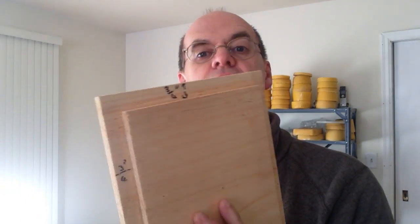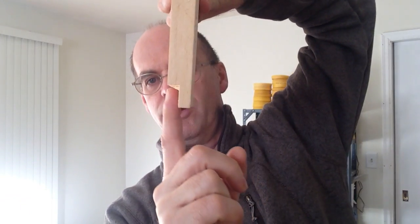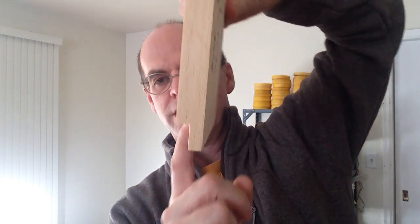I'm not a woodworker. I only make these when I'm alert — I've got all ten fingers and I intend to keep it that way. The most finicky cuts are on the table saw. I cut the rabbets with the fence on the table saw, running the wood flat through to make a three quarter inch cut, taking the same side all the way around. Having the same measurement means fewer adjustments on the table saw. Then for the three eighths cuts I set the fence to that, run the wood down the side of the fence, being very careful to keep all ten fingers.